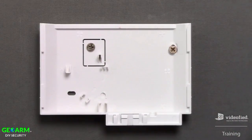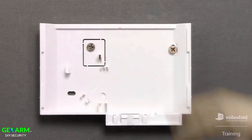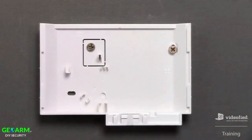I've already mounted the keypad's back cover directly to the wall. Keep in mind that this section is the most important here, as this is the tamper breakaway. In other words, if an intruder were to forcibly tear this keypad from the wall, this section would break off and the panel would immediately transmit a tamper alarm. So I'm going to close up the keypad at this time.